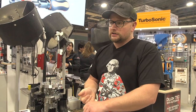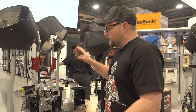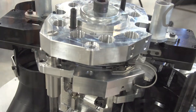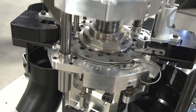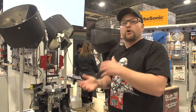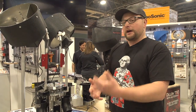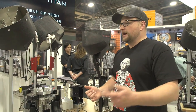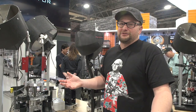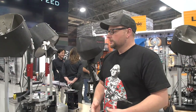You can load rifle cartridges and pistol cartridges. We will be doing more work with this setup because there's a lot of things to go into that we don't have time for here. Everything is automated and really easy to set up and use. You can get different tool heads and different shell plates. Basically, you drop this big bolt right here — it's a setup process similar to running any progressive press, where you change out the shell plate assembly and die/tool holder. I would recommend, if you're going to run multiple calibers, buying dedicated tool heads and shell plates for whatever cartridges you're loading and just set-and-forget. If you're going to turn out a ton of nine millimeter with something like this Titan running pistol cartridges, you're talking 20,000 rounds in just a couple of hours. The production capabilities at full speed and maximum efficiency, if you're willing to keep it fed with components, you can really crank some ammo out on these things.